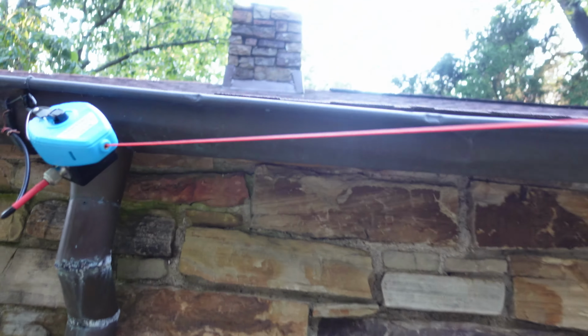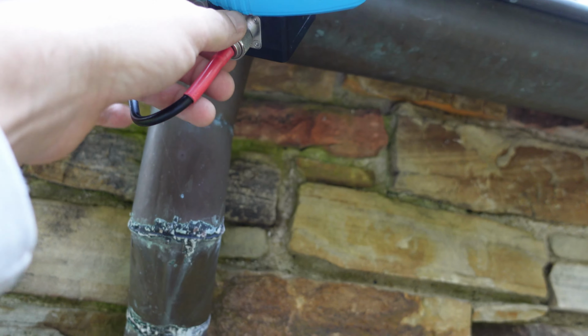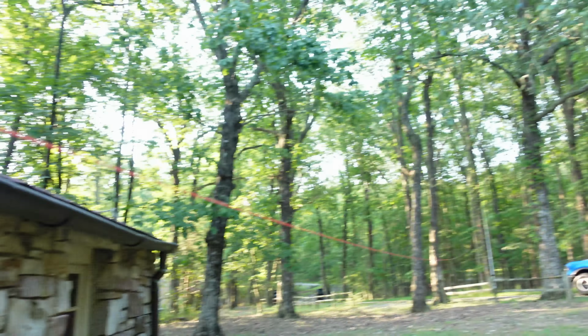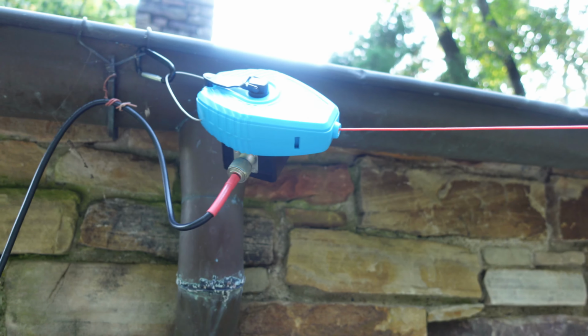Ryan said that when he did his POTA, which he plugged in the SO239, thanks Ryan, he had the wire, which I believe is 65 feet, all the way extended out. And then he reeled in about 4 more inches to be resonant, just in case we didn't hear that earlier.